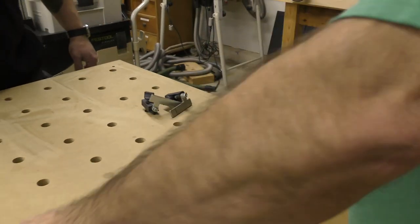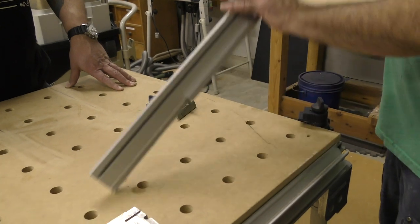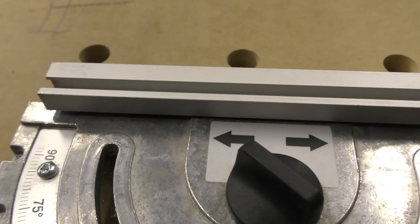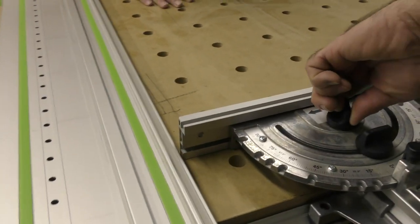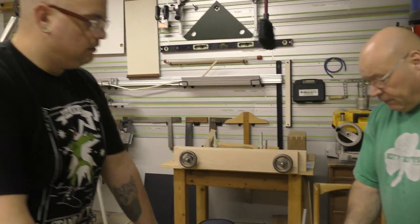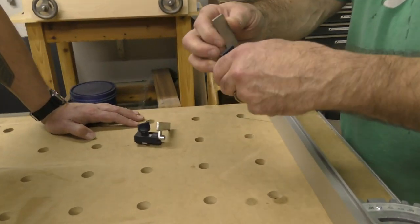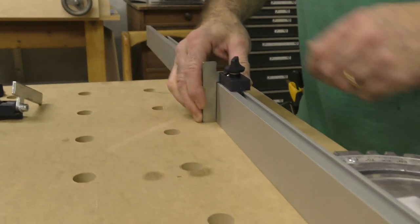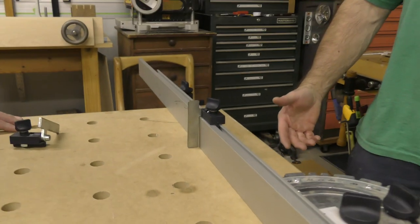What if you have multiple three-quarter pieces? Those would slide here as you stack them. Right. But you can take this, you see this bottom groove? You can stack it like this. Go ahead and set that down. You can stack it like this, and you can stack three-quarter pieces and cut them simultaneously. Oh, nice. And that's why you have this like this, and you can still lock it down. But you see this? Then this stop now works like this, all the way down. That's why we have that long leg on that stop. Awesome. Okay. Capiche? Makes sense.